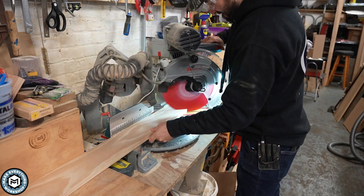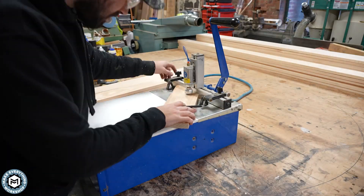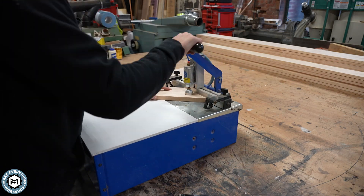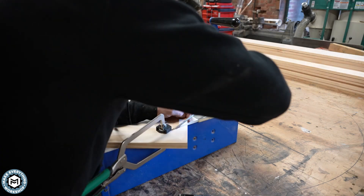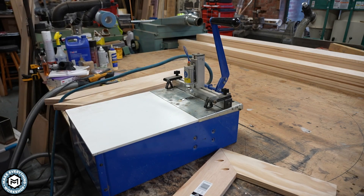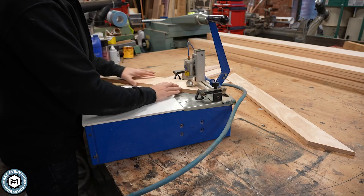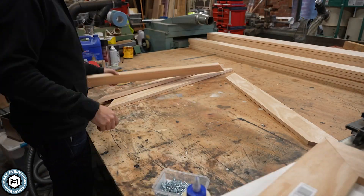I'm going to be doing most of this on the miter saw. I have to make three of these, and I'm really only going to show the process of making one. Basically what I did was cut my miters on the miter saw for the bottom section of the planter, and now I'm over on my workbench using a Kreg Foreman to put some pocket screws to give a little extra grab on these miters. These are pretty much structural because they're going to have a plastic planter inside to hold the water and the dirt, but they're going to be pretty heavy.